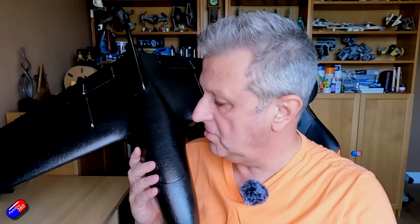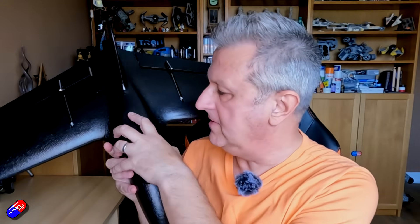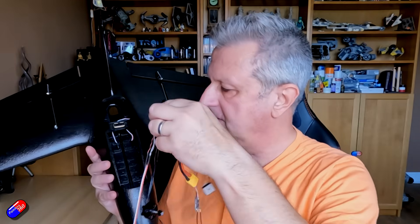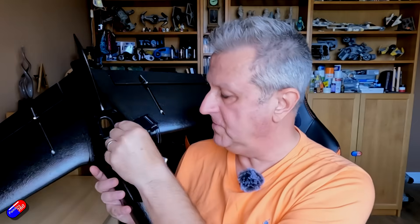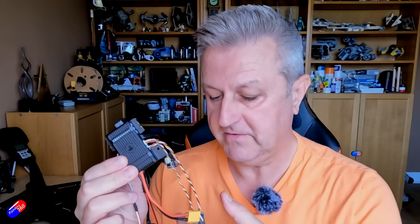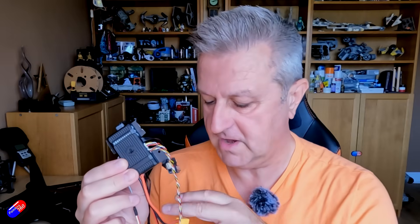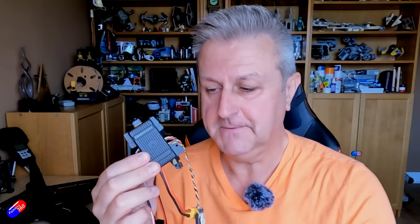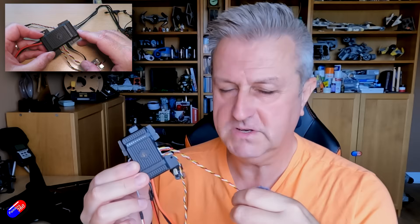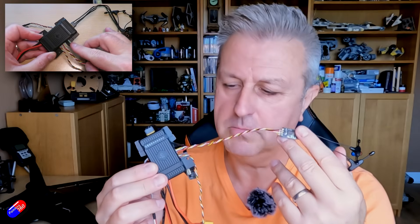This is the plane I'm currently building out with this unit, and there is the perfect spot for it at the back. It's going to end up in the next video with everything installed. The way I like to do these things — as those of you who watch the channel will know — is to set it up on the bench first: GPS locking, receiver working, motor able to run. All those things are tested so that when I put it into the model, if something subsequently doesn't work, I know it's probably because I've plugged a cable into the wrong place.